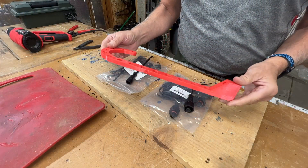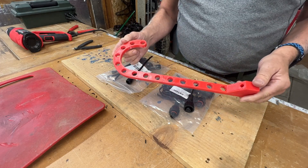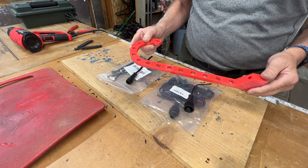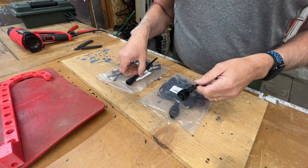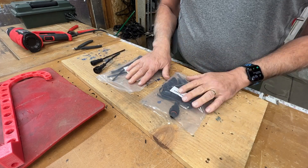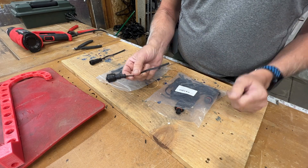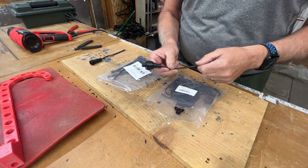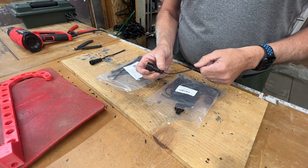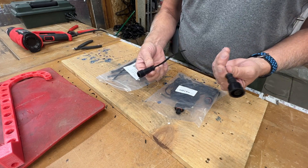Each of the candy canes has 14 pixels in it, which is kind of an odd size. What I do is take a string of 100 and cut 14 a piece — it leaves me with two leftover at the end. I need some pigtails to connect each of them up, the male and the female end. I got these from Wally White — Wally's Lights. They're seven inches long each, and that'll give me about a foot of space between each one, which is perfect for the effect I'm looking for. The next step is to cut a string of 14 and solder on the male and female ends, then put it into a candy cane.